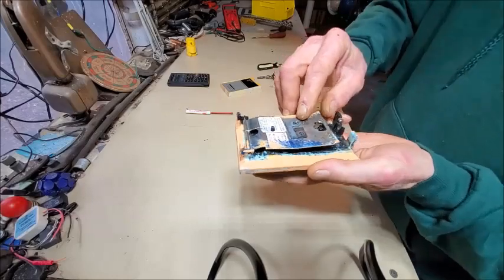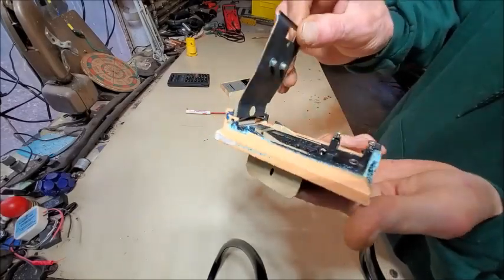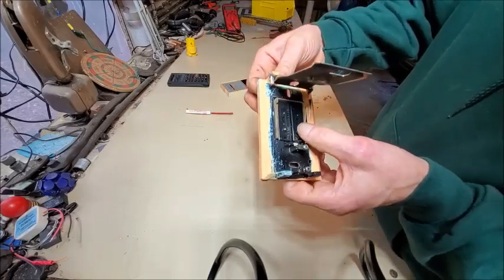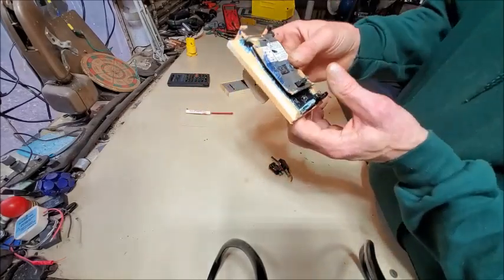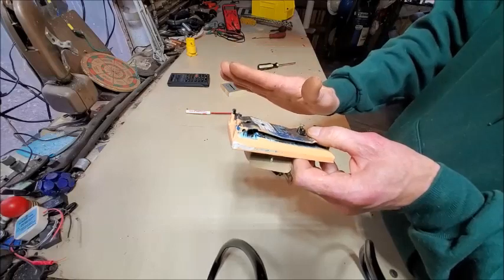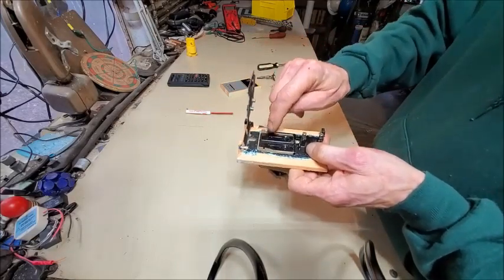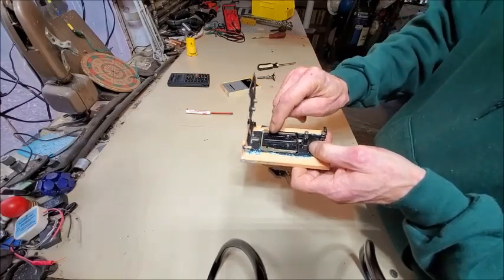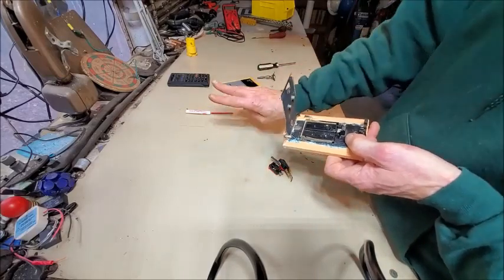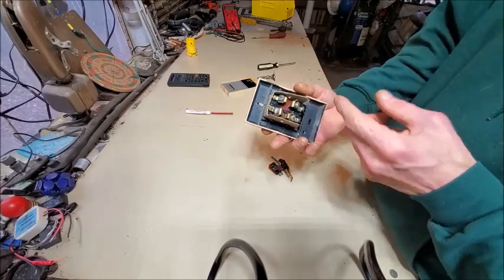So that's what's going on here — this is a full-on mechanical thermostat. These two screws are the business end, because those screws translate on the other side as a head, and those heads line up with the button that makes or breaks the switch. What I had to do yesterday evening was sit out here and calibrate both screws so that when this metal changes shape in relation to temperature, both of these are coordinated together, breaking both circuits. This is intended to transfer 120 volts up this leg and 120 volts up this leg to power a 220/240-volt baseboard heater. These are designed to withstand up to 20-some amps — I only need a half amp.